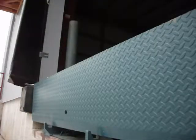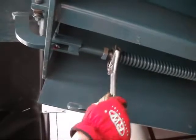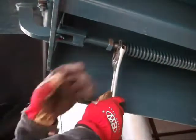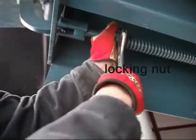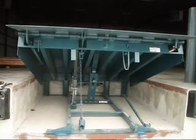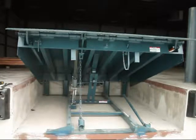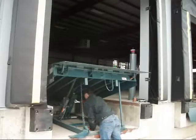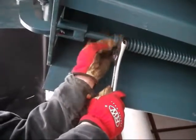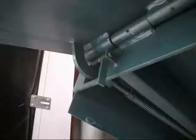The lip is pretty heavy, so most units have what they call a lip assist spring, which pushes the lip outward. This spring isn't quite strong enough to extend the lip — it just counterbalances some of the weight so the chain doesn't have to pull so hard on the lever to make the lip extend. It's the momentum of the deck traveling upward that makes the lip extend; the lip spring just makes it easier for the cable and lever to do their job. If your lip doesn't extend all the way, you most likely will need to add tension to the main springs and leave the lip spring alone. If you do decide to adjust the lip spring, keep in mind you'll need to take big swings at it to get any noticeable improvement. If the lip spring is too tight, the lip won't want to drop or may not drop all the way. If it's too loose, you run the risk of breaking the chain or lever welded to the lip.